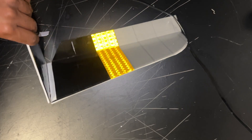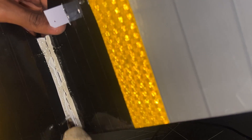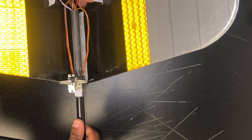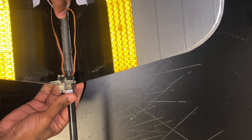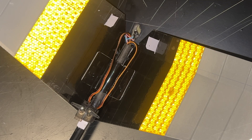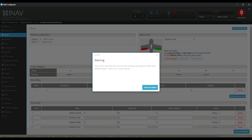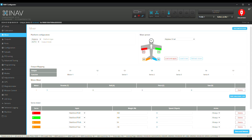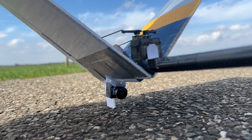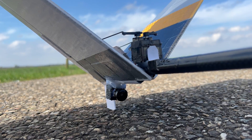The stabilizer structure turned out to be very strong and solid, so I removed the tape and paper from the middle of the V-tail structure and glued the V-tail onto the carbon tail boom from the bottom up. This required me to eyeball the structure to point perfectly straight and level, and it turned out to be so. I then took a third plastic card, formed its shape, and glued it from the top onto the boom and V-tail for additional stiffness and structural integrity. Finally, I configured the flight controller to operate a V-tail by going to the mixer page in iNav, then re-glued the FPV camera underneath the V-tail, along with a landing skid made of a double-folded plastic card and the tail light glued inside the end of the boom.